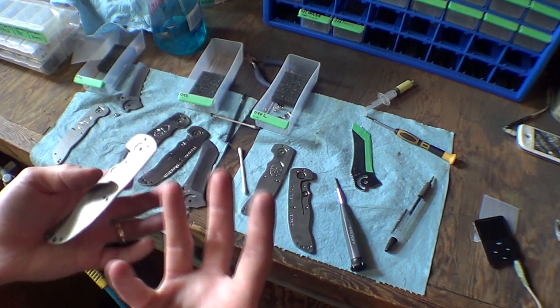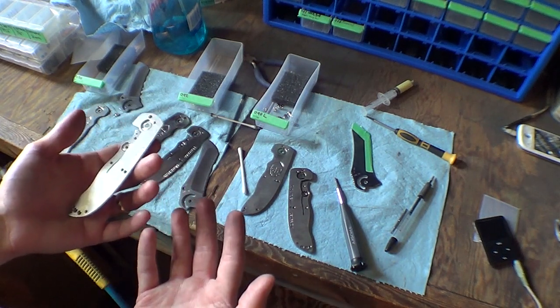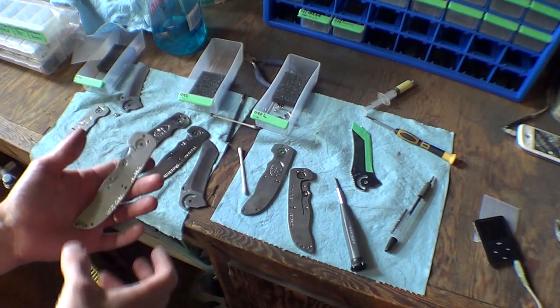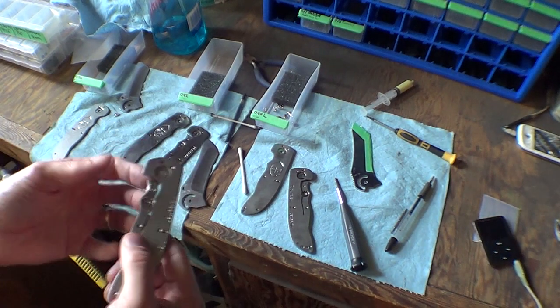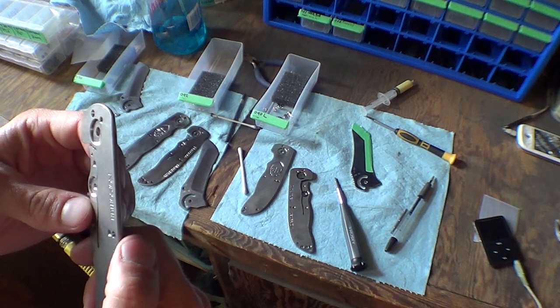And for some reason I must have had an offset wrong, because probably 30% of them work perfectly first try. But most of them, the threads just aren't deep enough. So I must have had an offset wrong when I made all the handles.